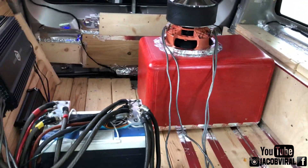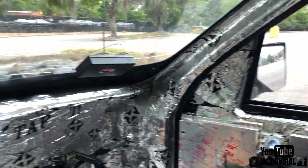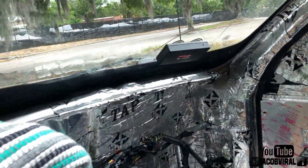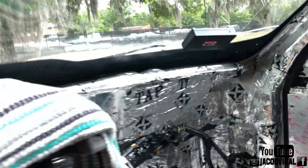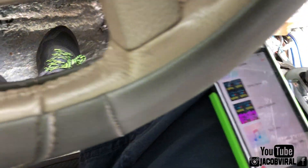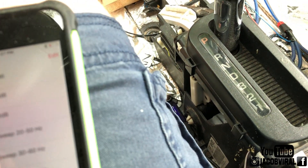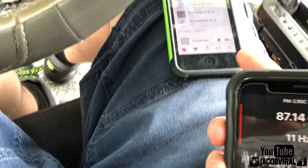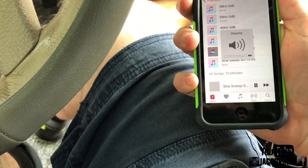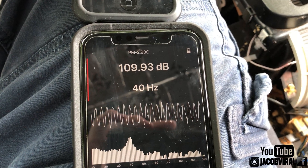So single 10 — in the other videos you saw. So let's see how it does. I got the meter up there. Right now I'm going to start with sealed on the glass just because. So we'll start with low volume so we know what the peak is. We'll go to test tones and make sure the bass knob is all the way out. Do a sweep real quick. This sweep is going to find out what the tuning is, or where I peak at.